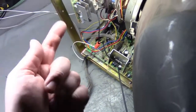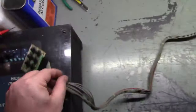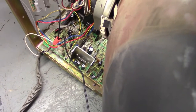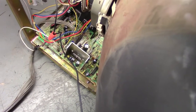Okay, it's on the tube, ready to go. We got all five connections made: anode, neck, yoke, ground, video, and of course power - so six if you want to count it, but those are the ones you need to make sure you don't blow something up. We got our remote board here on the control panel since there's no plastic case - don't want it to short out to the frame of my workbench. Let's fire it up. I couldn't find anything wrong, so I'm imagining it will turn on.